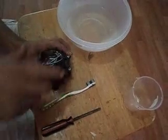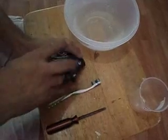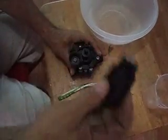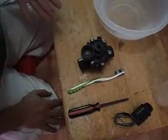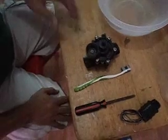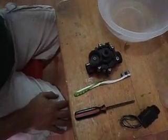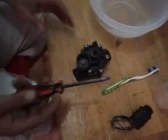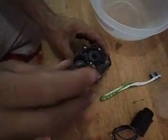Since you have your valve underground, you can remove the solenoid, obviously, and don't forget to shut the main water supply off, because if you don't, you're going to have water squirting out everywhere. So first, you shut the water off from the main shutoff valve. Next, you remove the solenoid, and now you start to remove the screws from your bonnet.